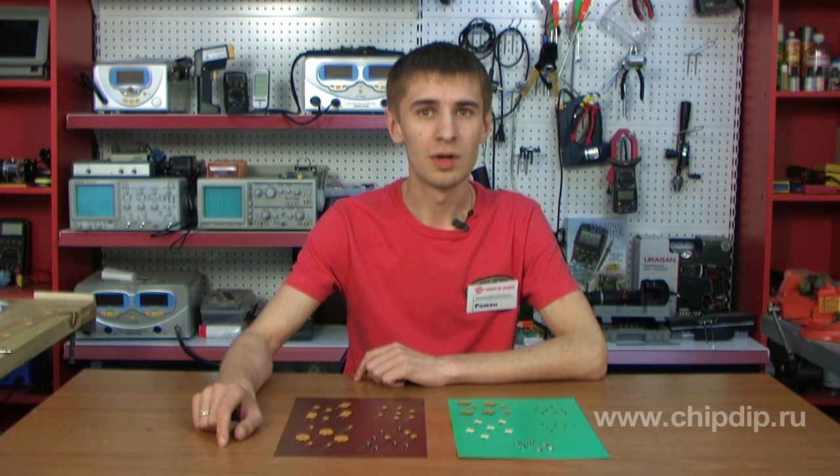Finally, let's discuss the maximum operating voltage for PTCs. Only the TR series has a maximum operating voltage of 250 volts. All the rest are designed for lower voltages, ranging from 6 to 90 volts depending on the series. This characteristic should not be overlooked, as voltage overloading will instantly destroy a PTC.